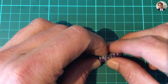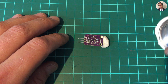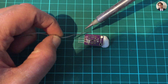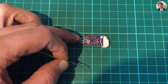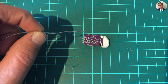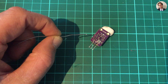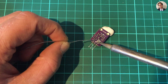Let's heat up the soldering iron and I'll get out some white tack just to hold it still. I'm going to use 0.7 millimeter solder wire. Let that cool down — normally when I solder I have a fan that blows away the fumes so I don't breathe them in, but it's kind of noisy so I didn't turn it on. Let's do the ground pin and the output pin.